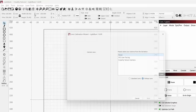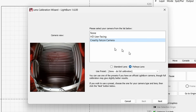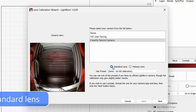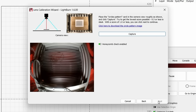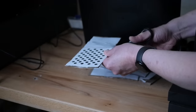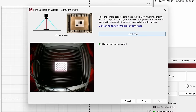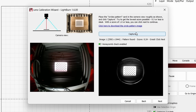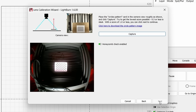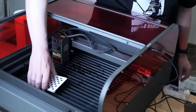From the laser tools menu, choose Calibrate Camera Lens. Select the Falcon 2 Pro camera, then select the lens type. At first I thought the lens was a fisheye, but couldn't get any good results with that option — make sure the standard lens is chosen. Click Next and then the blue link to download the calibration pattern. Print it, glue it onto a piece of cardboard, and cut it to the size of DIN A6 or a 4x6 card. Now place the calibration pattern in the center of the workspace as shown in the image and click Capture. You should see the captured image and a message telling you if the pattern was detected well enough — the value should be below 1, and the closer to 0 the better. If it doesn't work, try to get more light or just click Capture again. When the detection is good, click Next and repeat the steps until the calibration is finished.